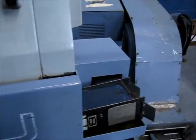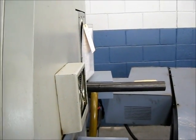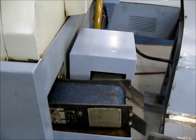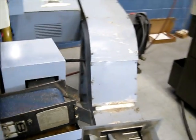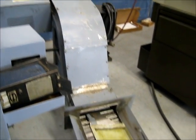This machine does have, right now, a tube coming out for rear ejection, although the parts catcher is in the box. It does have a part conveyor and a chip conveyor, so you can use gang parts ejection.